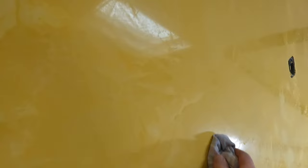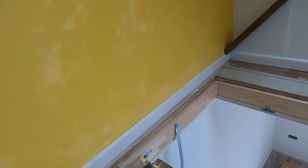For the final part, get a cloth, grip it tight, and gently rub the wall to give it that final polish. This ensures you get that smooth, glass-like finish at the end. A lot of people buy buffing machines like they use for cars, and I'll probably invest in one once I get more into it, but you can absolutely do it by hand. In terms of equipment, it's very basic: two small Venetian plastering trowels, the Venetian plaster itself, a filling knife to apply it, and a couple of rags — one to clean your trowel as you go, one to buff the plaster.